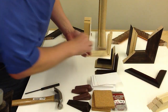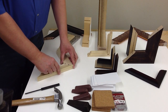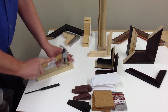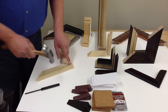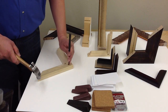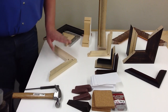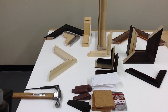There's one more example — also a stretcher or strainer frame, this time using two keys. Same idea: apply some glue, slide the pieces together. If you're too close to your lip and worried about hitting it with your hammer, use an eighth-inch diameter round steel punch from any hardware store, set it on top of the key, and use that to seat the key without marring anything around it. So there you have it — a couple of different ways of joining custom picture frames with the Hoffman Dovetail joining system.